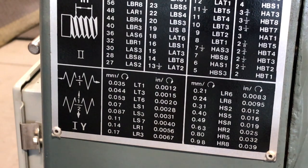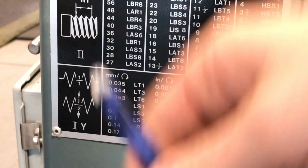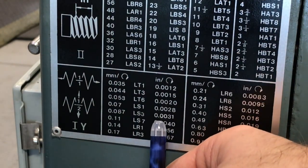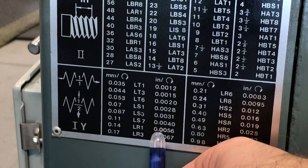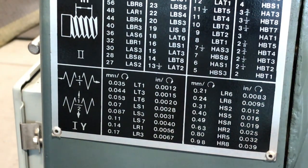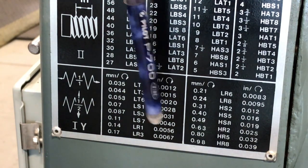The first thing I want to point out is how to set this thing up. The typical one we use is down here near the end — it's 0.0056, which is like five thousandths of an inch of forward travel for every revolution.